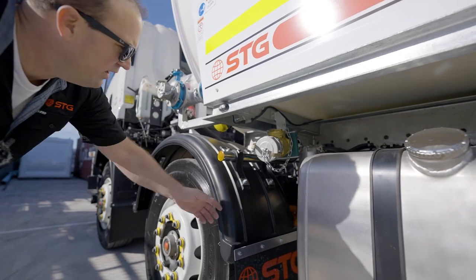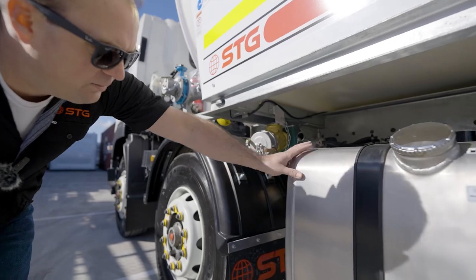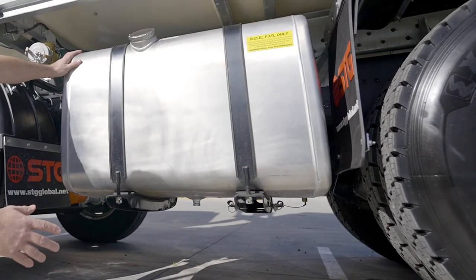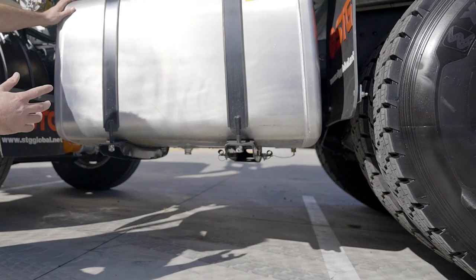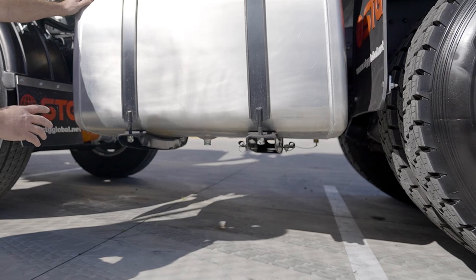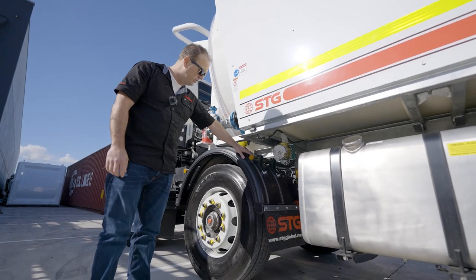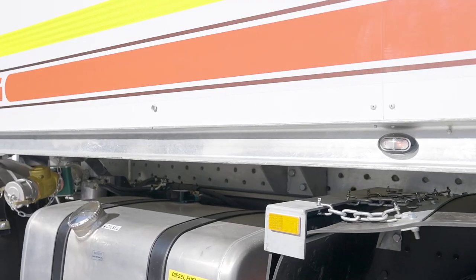While we're having a look, let's check out the fuel tank and make sure it's in good condition. Have a quick look under the truck — is there any leaks around that fuel tank? Obviously we're working off-road with big rocks getting flung up, so we need to make sure our tanks aren't cracked. Moving forward to our front guards — these are plastic guards. Check the bolts are all secure, our mud flaps are in position and our side lights are looking good.